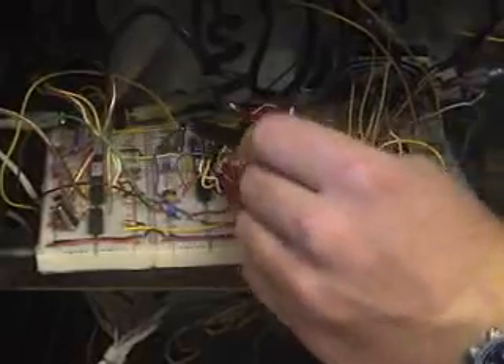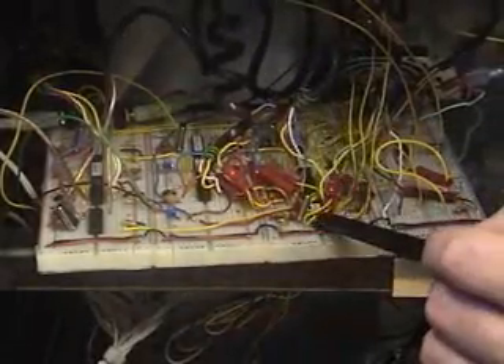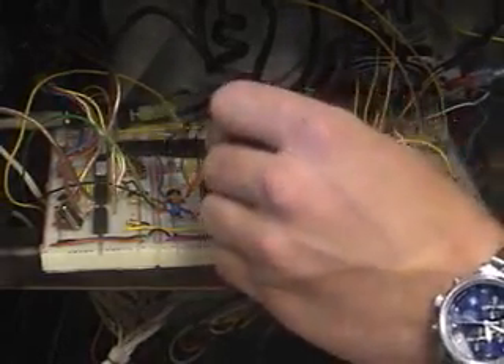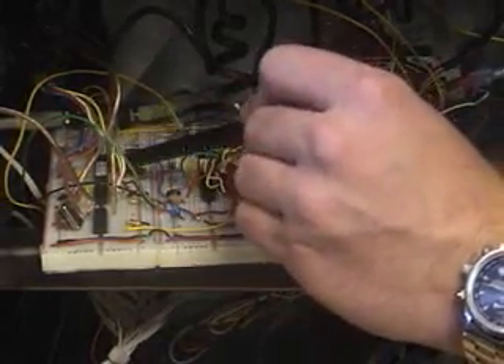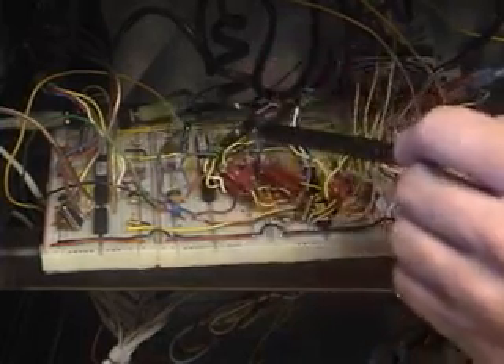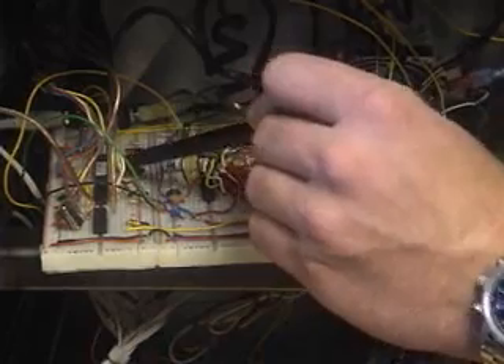We have five PICs. We have one PIC that controls the blinking LEDs on the top, and a PIC for each stepper motor. We have the master PIC which displays the position, handles the LCD output, and controls the solenoid. Each stepper motor PIC controls a bipolar stepper motor controller, and the stepper motor controller runs the L293D H-bridge.